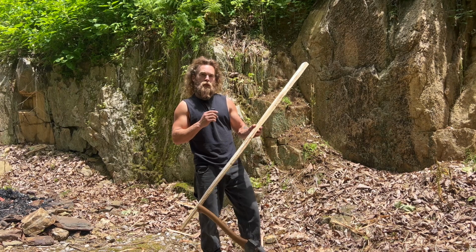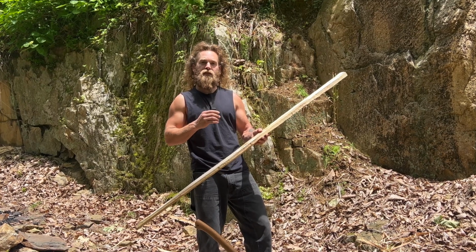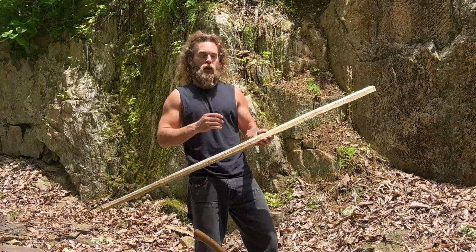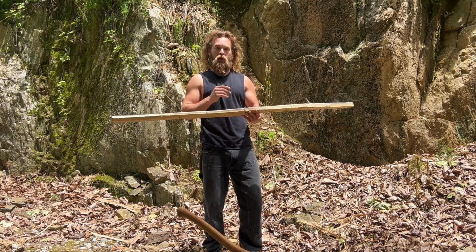There you go. Most of the sapwood is now removed. I was using the hatchet here. Now I can come in with the draw knife and more technically advance into the heartwood. I want to be careful here because I'm chasing a ring. Any violation made in the back of the bow will result in a weak point, and a weak point could be a broken bow.